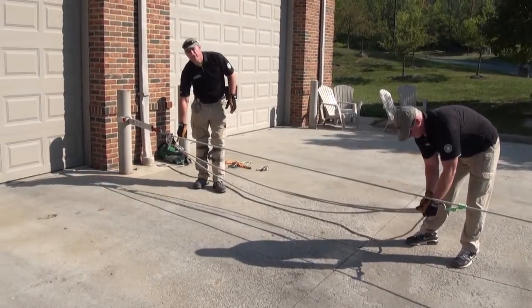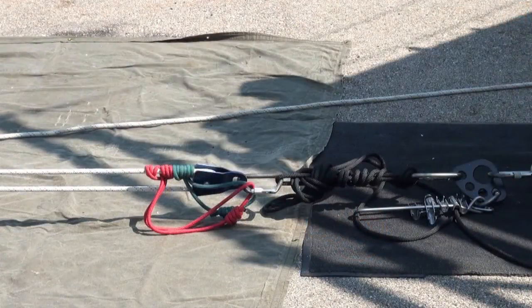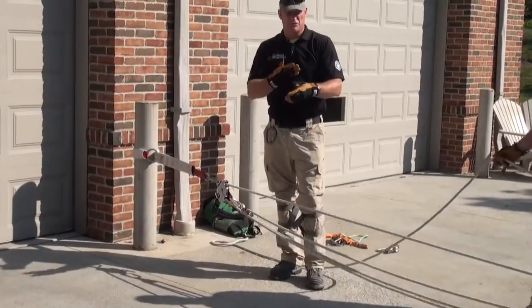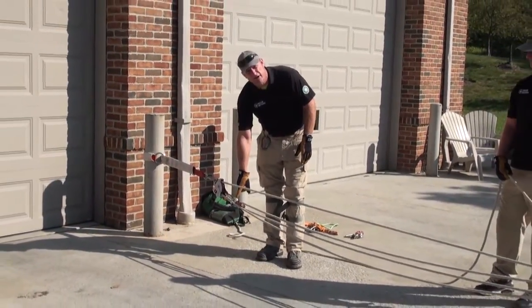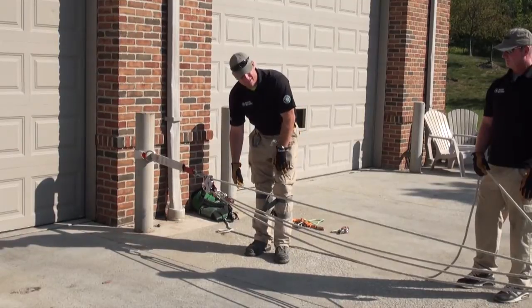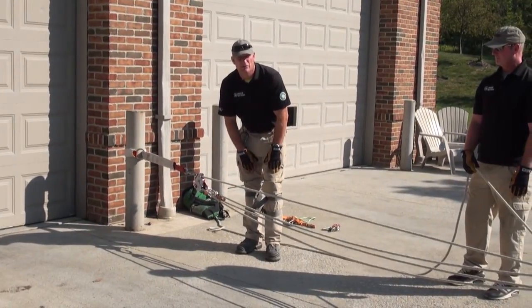Because we're operating off a Beckett, we don't have the ability to laterally spread out attachment points on a rigging plate. Take time to look at the system and how it's feeding in and out of itself. If you rig these systems in and go to haul with rope-on-rope action or twists, you either need to correct it through your swivel application and spin the pulley around, or re-rig to ensure all lines are running as clean, straight, and neat as possible to maximize your mechanical advantage.